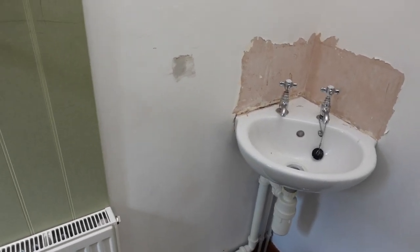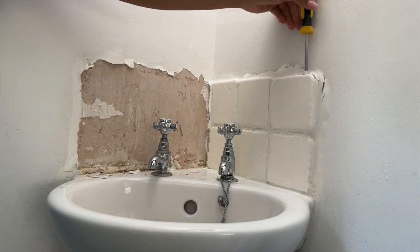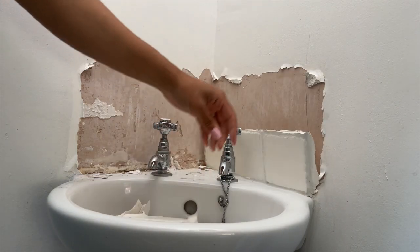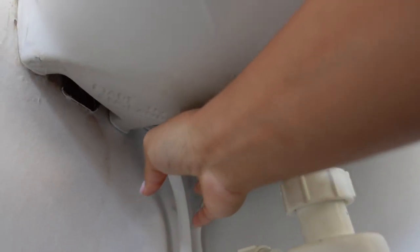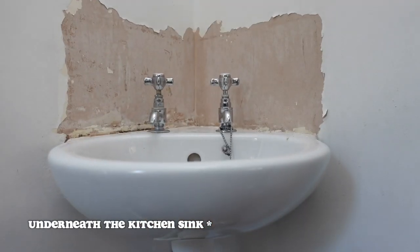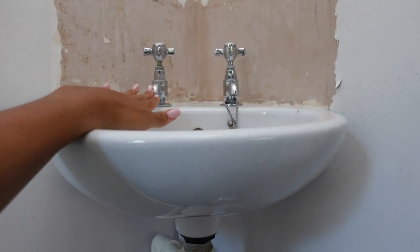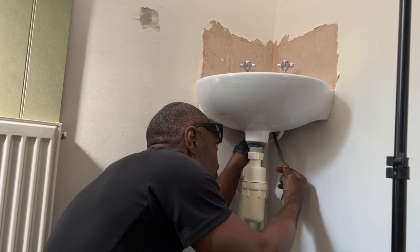In order to get the panel in behind the sink, I don't want to just cut around it — that would look shabby. I want to do a proper job. To do that I have to cut the sealant and silicone, and then I've realised I need to get under here and undo the taps so I can take away these brackets. I've switched off the water supply from the tap underneath the sink so I can remove them without water going everywhere, then pull it away, put the boards in, and that should be it.